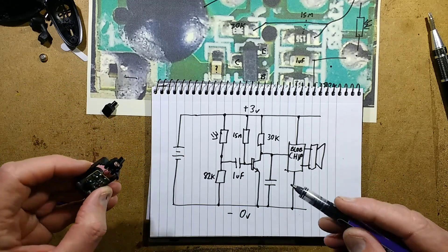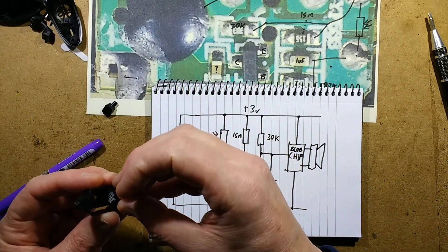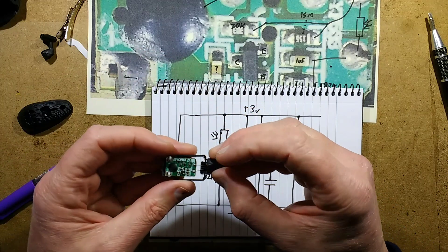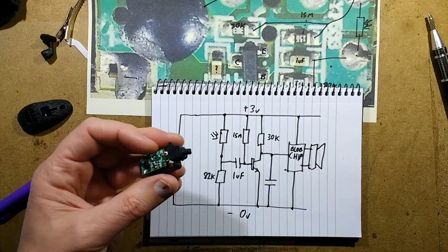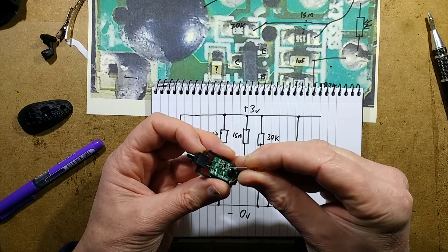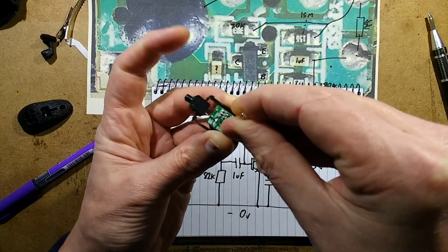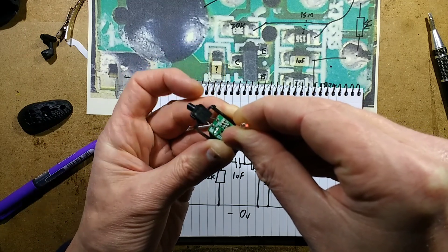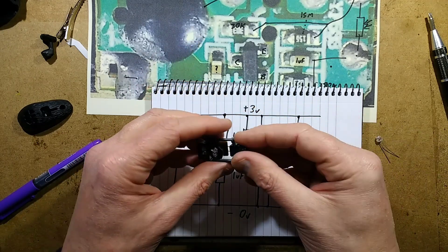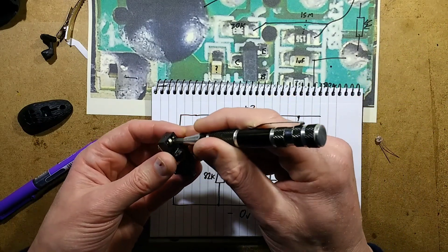Can I emulate that? Would it be visible if I stuck an LED across that? Let's put the battery back in at the risk of lots of crowish, ravenish type noises — quite annoying. And let's get an LED and put it across — it's probably ill-advised — but I'll put it across from the positive to the base of that transistor. Are we going to see that? Do you see it being — it's reacting to my finger going in front, with the intensity of the LED changing. It's detecting fluctuations. So that's fundamentally it. It's a very, very simple way of detecting movement.